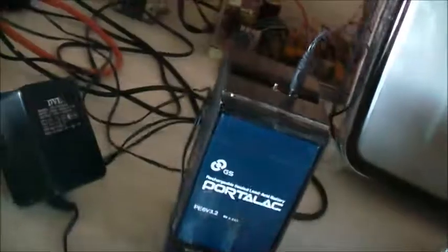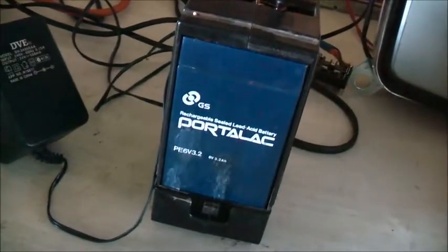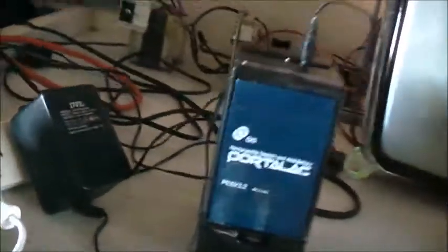Most of it's sulfation anyway. I've got another desulfater coming in the mail which is capable of batteries more than 12 volts, so I can use them for these 18 volt battery packs - give them a pop of desulfate. But that one's settled down. I could probably stand this up right now. Charging up quite well.